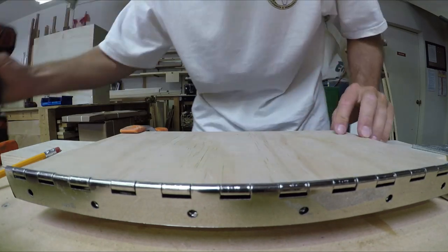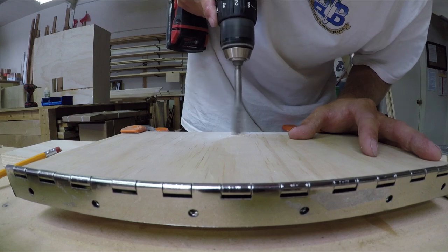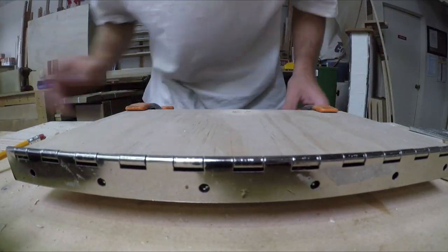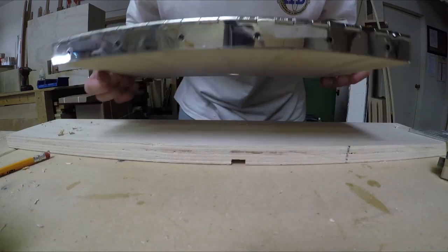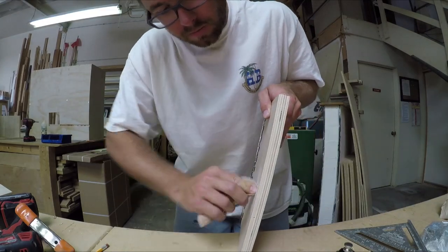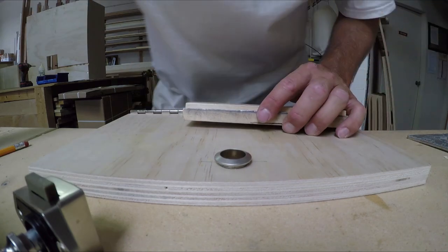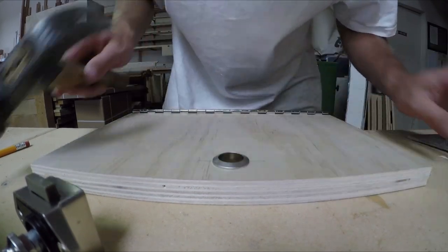Get your spade bit and watch what happens once I use this extra block of wood down here. Right on the line — put pressure down, keep everything as straight as possible. So remember, that's what we had before — now that's what we have now. Super clean. I always like to give every hole I drill a nice little eased sanding around the edges. Here is your little bevel on the outside — that's where I'm going to set it. Sometimes it goes in super simple, but I'll show you how to make it go in tight without smashing it with a hammer — just a little block of wood. Boom, it's in. Perfect.